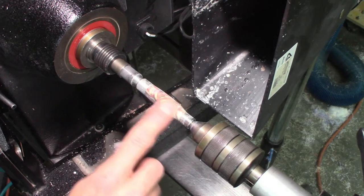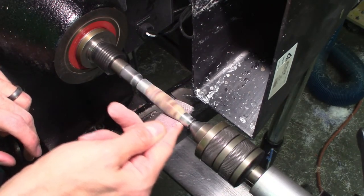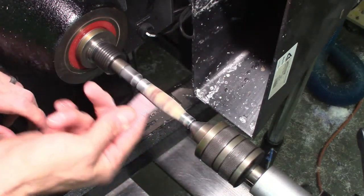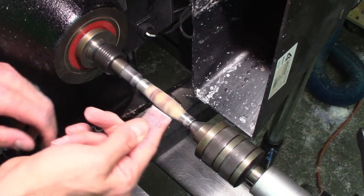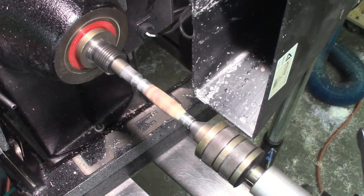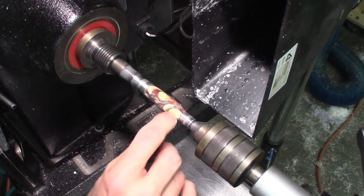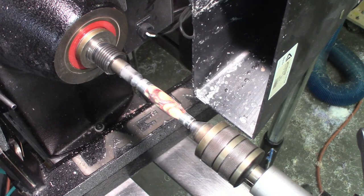Definite low spot right there. Alright. Probably gonna have to pull out the medium again to fill that. I think what's happening is I had sanded it back down into where you had the shell. So what I need to do now is fill with more CA glue to get that covered. Yeah. All right, so like I said, it's a process, guys.